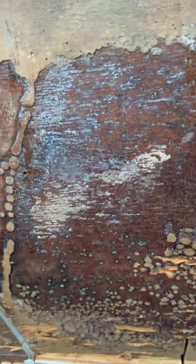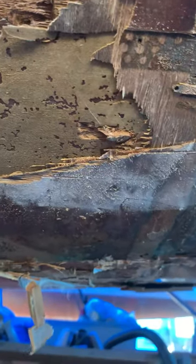This area forward of this scarf had enough epoxy protecting it that it did not suffer from this. We have some superficial mold growth there on the surface, but moving forward, you have evidence of some biological growth coming up underneath the epoxy. It's good. And coming down here, it's been wet, I can tell, but it hasn't gone downhill as much as this area has. I can say that it is exclusive to this side of the hull. Stops at the keel joint.